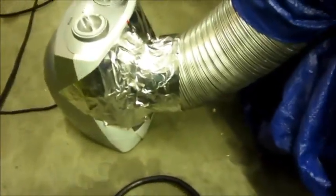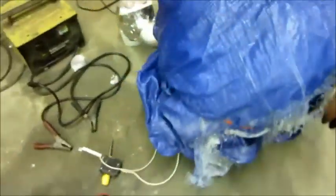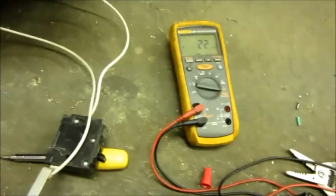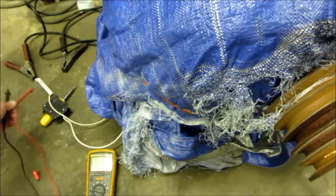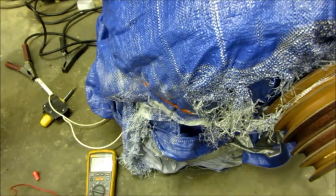This is my motor drying rig — a little heater with a tarp around the motor and a piece of dryer vent hose going in. You can see the heat coming out. It's been running all night like that, and the whole motor is too hot to touch. I had the battery charger hooked up to the leads to pass a low DC current through it to help generate more heat.